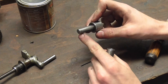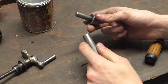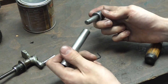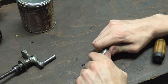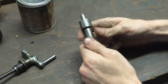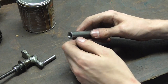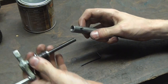By the sheen that the polishing paste left, you can see that the taper is bearing slightly more in the bottom than it does at the top, which may be down to this taper not matching perfectly, maybe the nature of the polishing paste, but fact is, it's probably adhering better than it ever did before, because I could put it together like this. And alright, I can still get it apart, but yeah, it was never this good before. So it's good enough for the coming owner, and you know, to me that's tailstock done. I'll now reassemble it, and then last thing to check will be the spindle, I think.